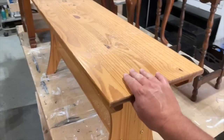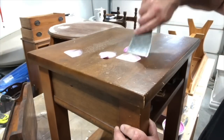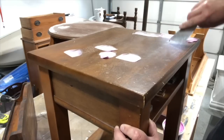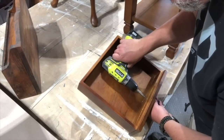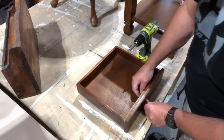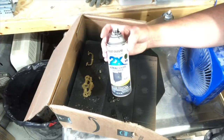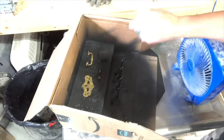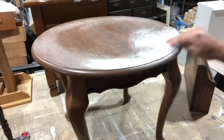For this bench, all he needed was the screws retightened. And then on this little side table, he just needs to spackle in where it was kind of beat up a little bit, just to give that a nice smooth top finish. For this other little side table, he was removing the hardware — there was decorative hardware on the round table even though it did not have a drawer. Then after cleaning it with some crud cutter, he is using our Rust-Oleum flat black, which is usually what we always paint our hardware with, giving it a few coats to freshen it up. Then it's on to hand sand wherever he had put some spackle, just to blend that all in nice and smooth.